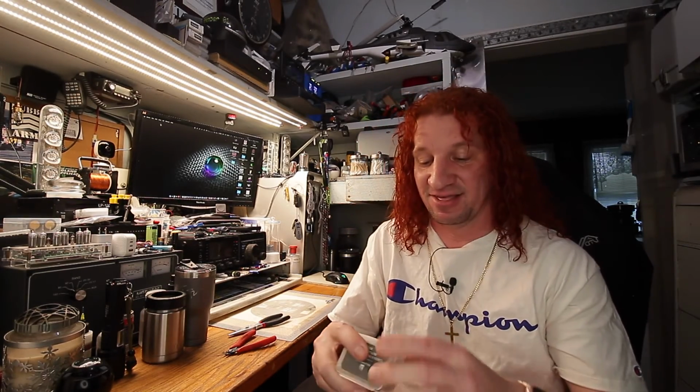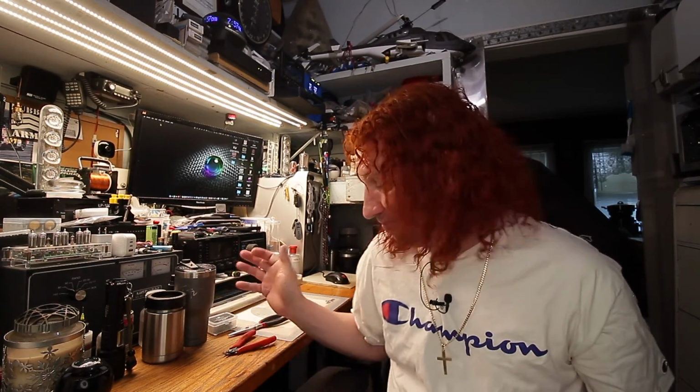And a little life hack to acquire additional bulbs so you don't run out of spares, and you can always keep your tree lit, because we all know with our Balsam Hill trees that we spent quite a bit of money on them, we want them to last as long as possible. So a little life hack for you. I hope to help you streamline some time off modifying the new style LED replacement bulbs to retrofit to your old style LED light strings on your Balsam Hill tree.